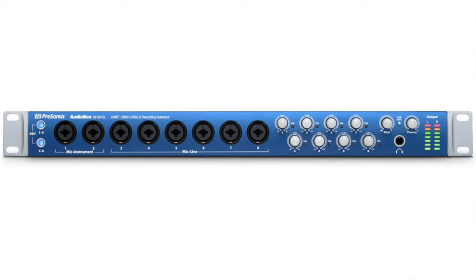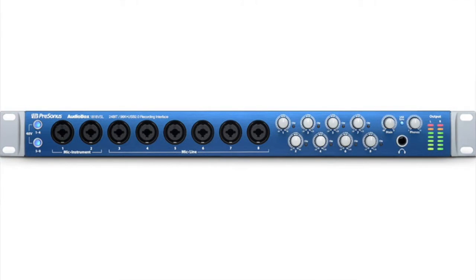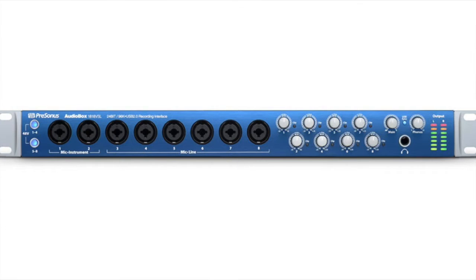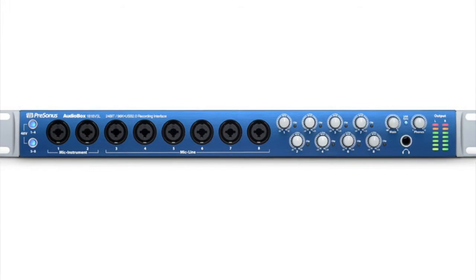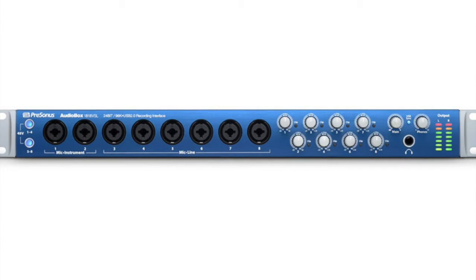The USB sync light. This light displays red when the USB connection is not complete. If the light shows red, make sure the USB running from the back of the interface is properly plugged into the USB 3.0 hub or the back of the computer. When this is done, the light should display blue to show the connection is complete. If everything is plugged in and does not show blue, try restarting the interface by switching the Furman M8LX off, then back on again.